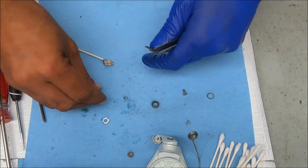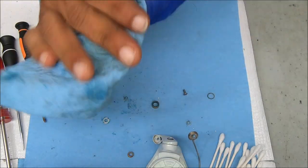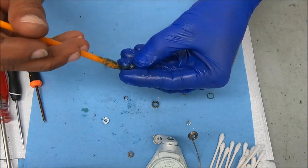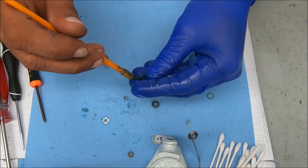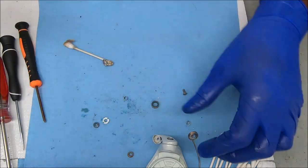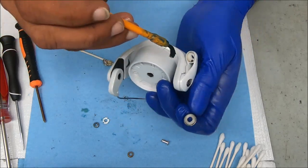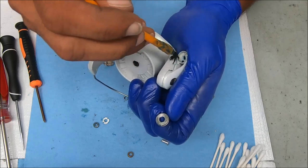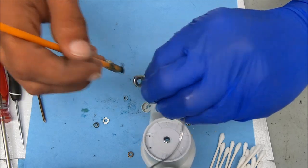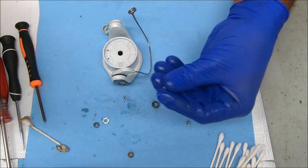Let's set that aside and then we're going to put this together. I'm going to oil this bearing, then grease these components here. The reason you grease these things is so you don't have the issue where things get frozen. Even though this is plastic I still grease inside that line roller and that bushing. Make sure this bearing has some good oil in it, then we're also going to grease that. All we're doing is adding a barrier so it helps protect against salt water or water getting in there.